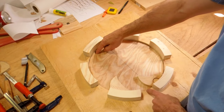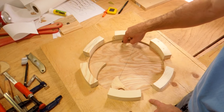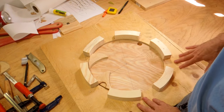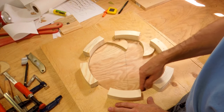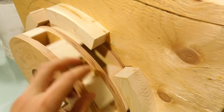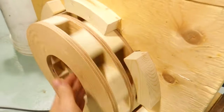But if I do, then when it's like this, the air can come out, and then it can't, and then it can again, and then it can't. And because I have the same number of these little winglets in here as I have gaps on the enclosure here, that will cause pulsating air to come out all of these, which should give it a very loud note. So here's my 6 gaps, and these line up with the gaps behind here.